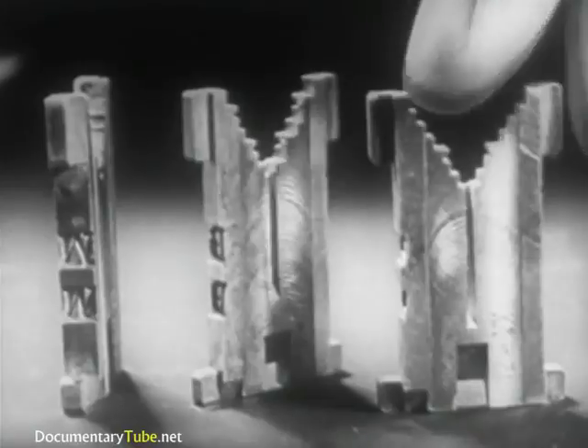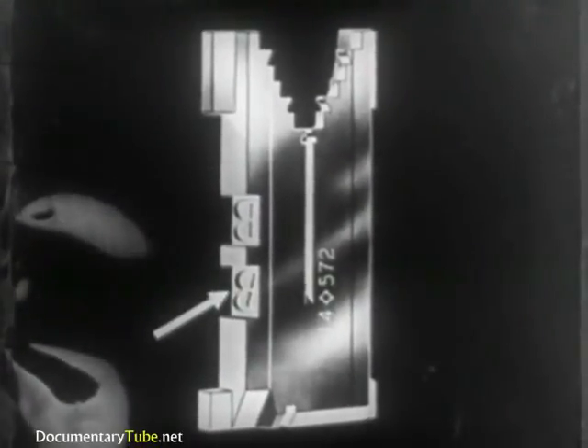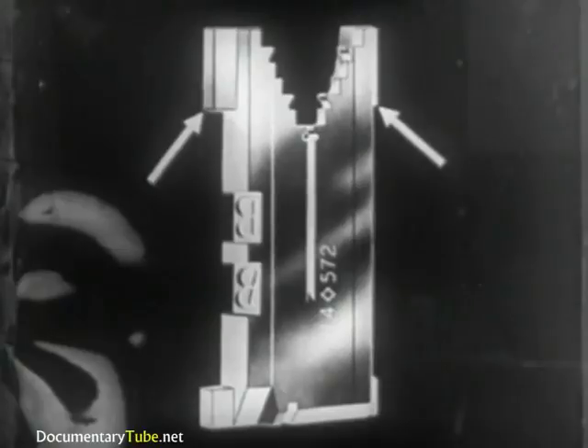Here's a close-up of some mats. You can see the letter that has been punched or engraved into which the molten type metal is going to be injected. Let's note particularly the two-punched character, one Roman in style and the other italic. The small lugs and ears which guide the mats through the various passages and assure the alignment of the letters.